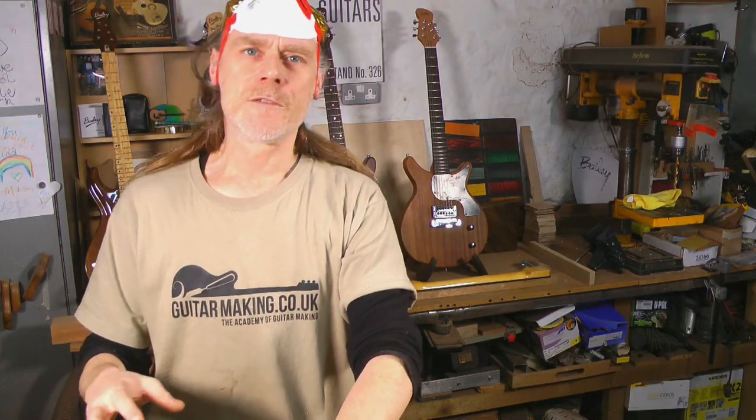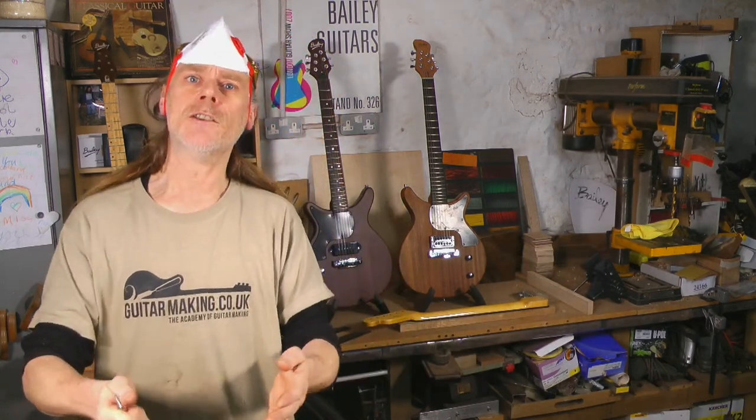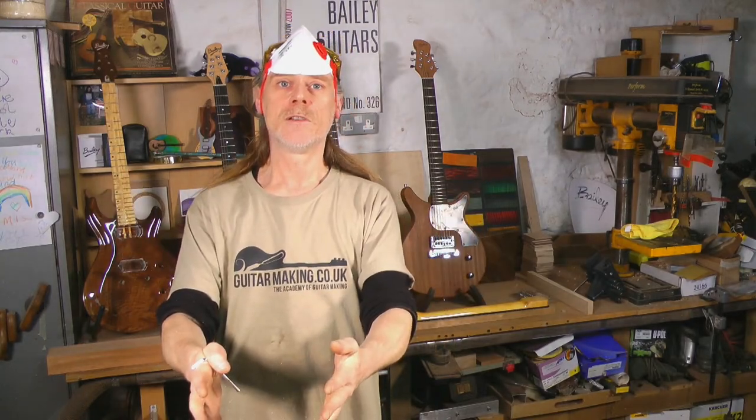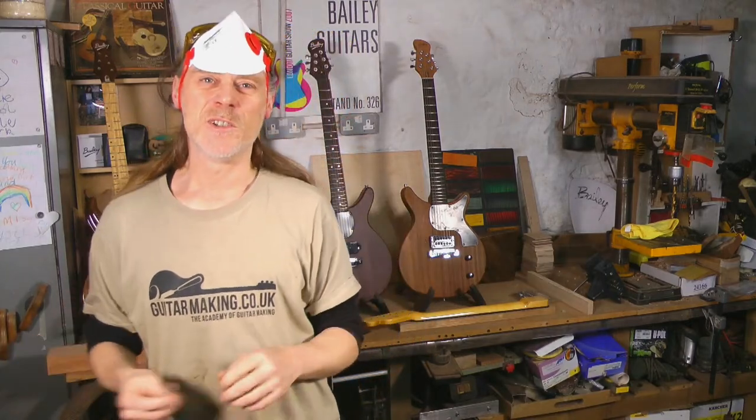So my philosophy is, if you unplug it every time you change the cutter, there's going to be that one time where somebody else is involved and they didn't unplug the router. Because I run courses, you see, and this actually happens. So when I'm running courses, I change all the cutters and nobody else is allowed to change cutters. And picture any professional workshop, a factory, for instance, they don't go around unplugging all their machines before they change the cutters. I don't unplug my router every time. My personal preference is to always assume that the router's live, and then I'm always really careful how I'm holding and touching the router. So that's just the way I do it.